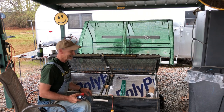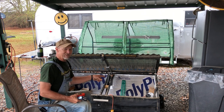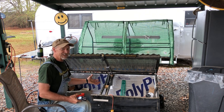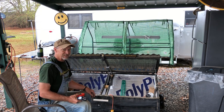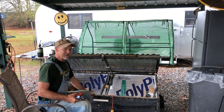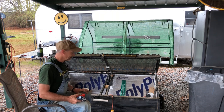It's 62 degrees outside. So that's why when you hook you something up with heat, you need a thermostat on it so your heat will go off. If you don't, you're going to be running electricity heating and your door's open, letting it out. So you got to get it adjusted so when the door starts opening, your heat goes off. Because there's a fine line in there to where your door might stay closed, but your heat's off, but it's keeping it on that temperature before the door starts opening.